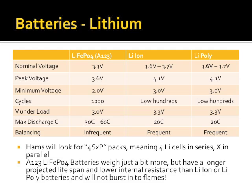You have cars out there that are running on packs that may have 100 of these batteries in them. And that's one thing that is pretty impressive about them, the technology is so foolproof you can build packs that big. Try doing that with nickel metal hydride AAs. It won't work. You really run into high failure rates when you get to more than about 11 or 12 batteries in a pack.